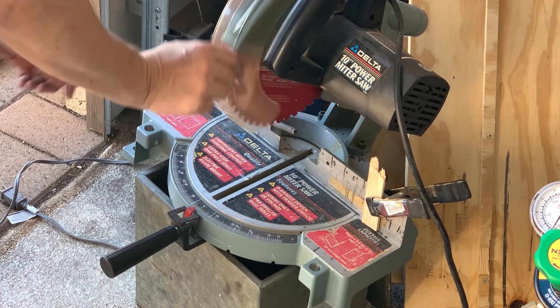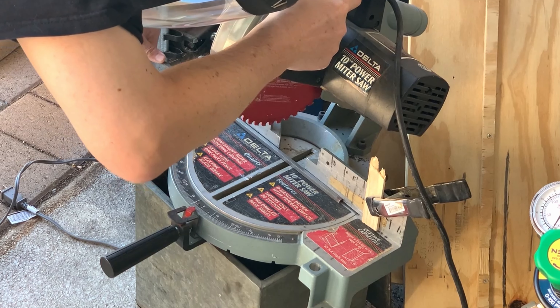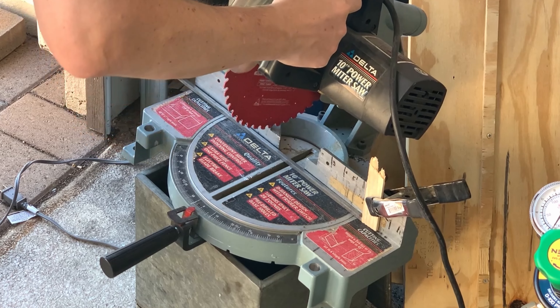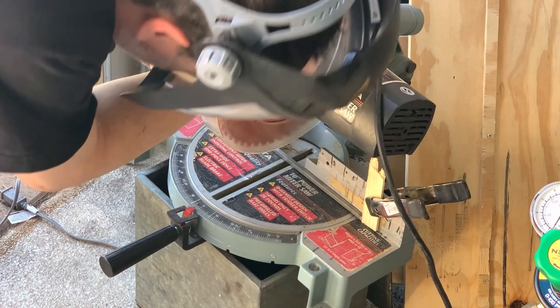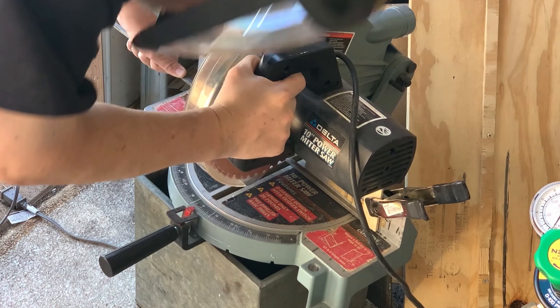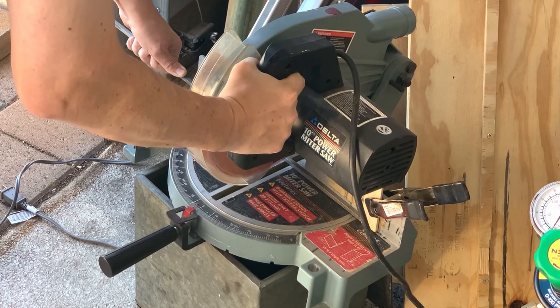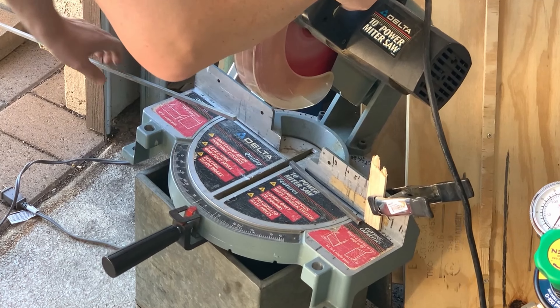Step 1: Cut to length. In this video, I was cutting them at 6 inches, which creates a very lightweight stick. However, towards the end of the cutting, I had a piece that was 5 and a half inches, and I have to say I was very pleased with its final weight. I'll be cutting them shorter and drawing them out with a more aggressive taper in the future.